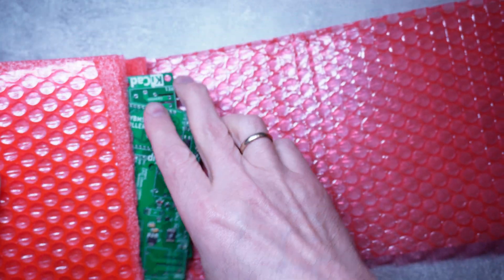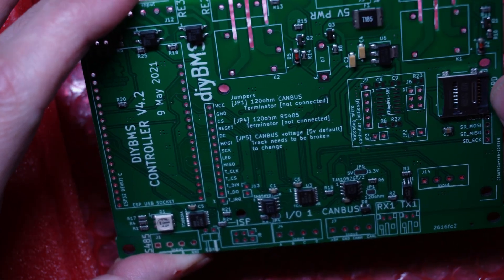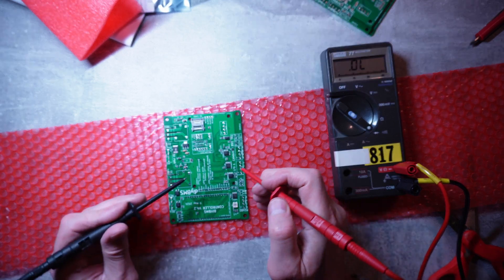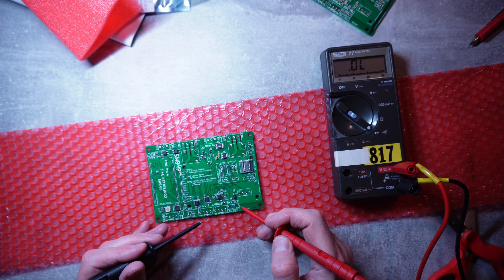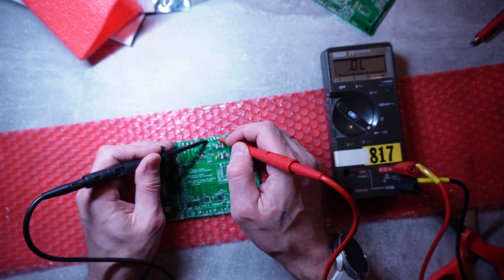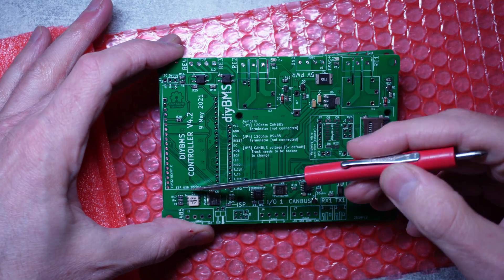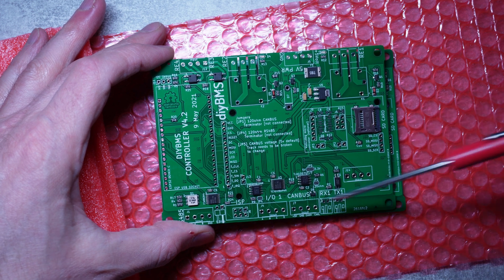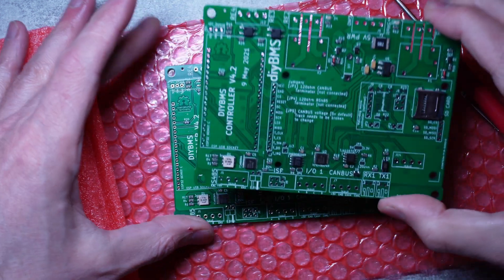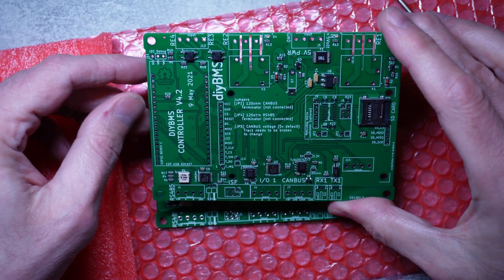And these assembled ones are almost ready DIY BMS. We do have a few things missing, but those are easily done by hand. I started from testing the controller to ensure there is no shorting to ground, and it seems to be okay. Now I can crack on with mounting the ESP32 controller and adding the other connectors I need, then basically programming the controller first. After that we'll deal with ordering the ATtiny for the module and hopefully get it all assembled and tested.